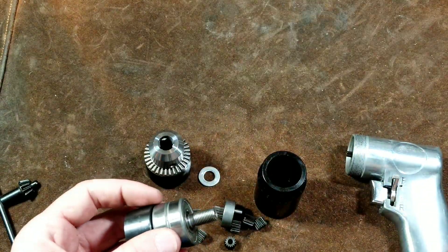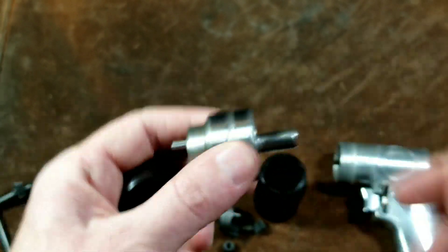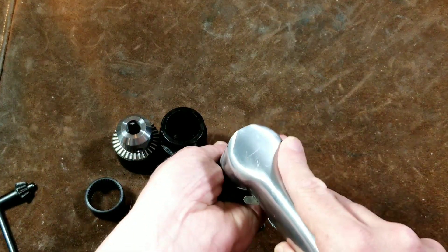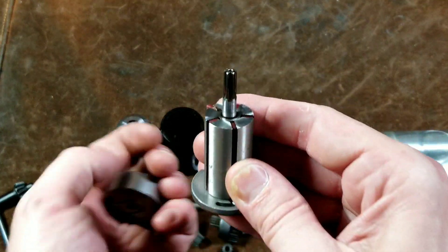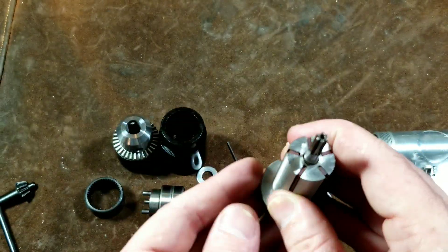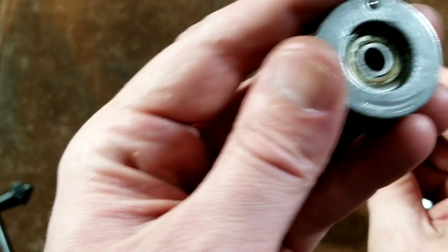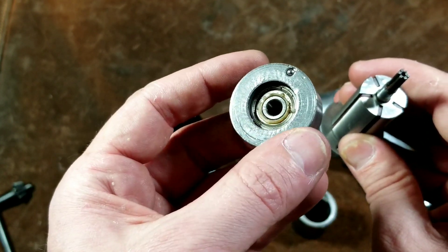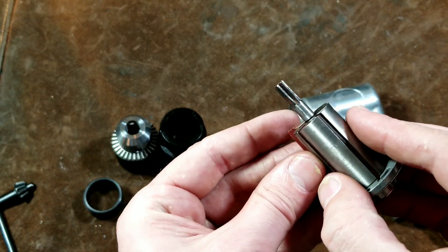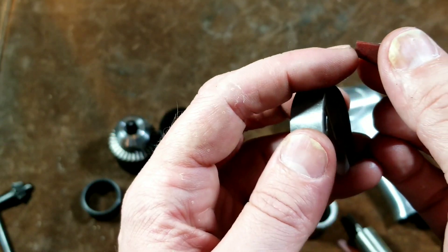This whole stack held in compression just on threads from an aluminum housing is just not a good idea. Even though they press-fit a couple of bearings on there, they're not rubber sealed by any means. It's just really not a worthy tool — it just won't hold up. Here we are with the air motor inside. Since this is one I just had replaced, it's just totally bone dry everywhere in the tool. The fact that it has a through-handle air port means basically no oil makes it past this front diaphragm here, so anything that may leak through the unsealed bearing — there's no lubrication for the front gearbox. That's another major issue, especially when it should be dry. And these little vanes — in my last one they had caught on some kind of burr and had just chipped up the vane pretty badly.